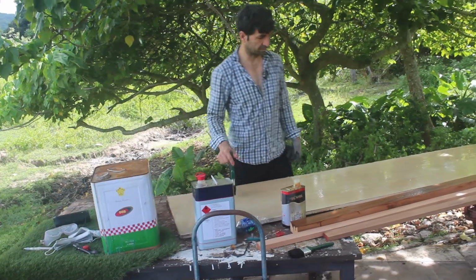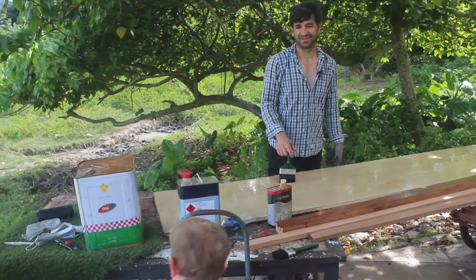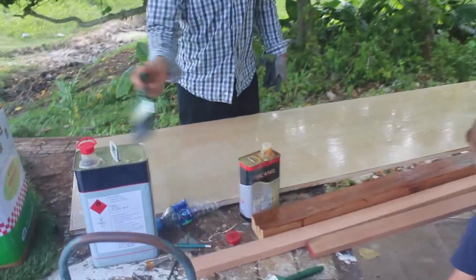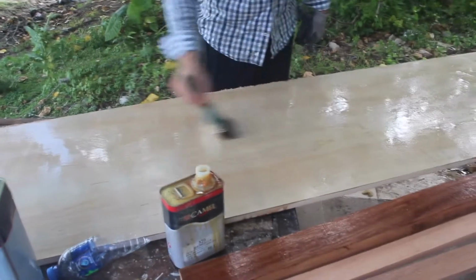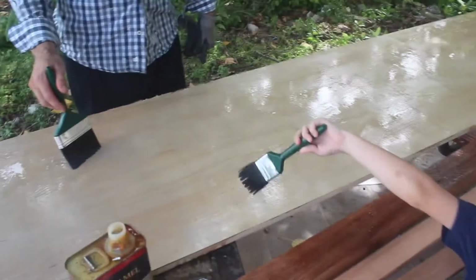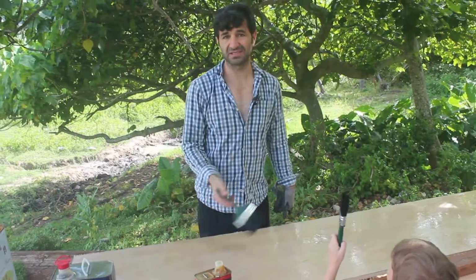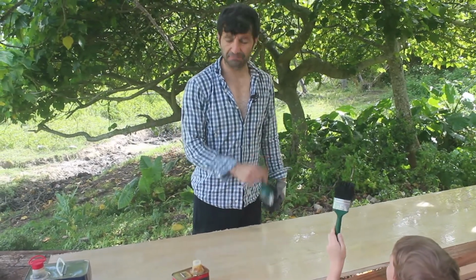The next step is to make the structure and the wood part. And before you put the wood in the work, you better do varnish. We got some different products in Hong Kong. You mix it with fuel and make sure that this gets soaked wet. It helps to prevent the humidity from ruining the wood, and prevents a lot of insects from building. And if it gets moldy, it's easier to wash or bleach it out. So this is the next step.